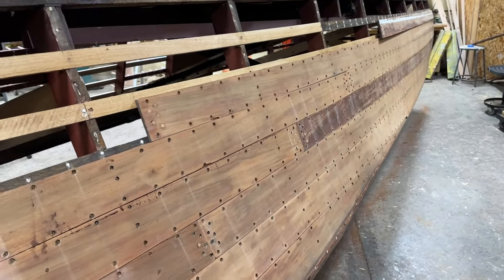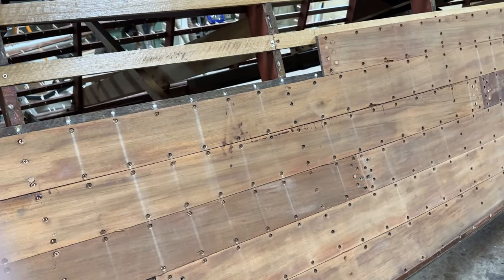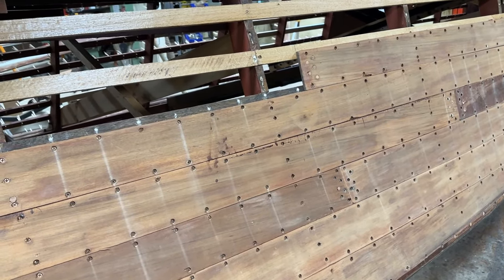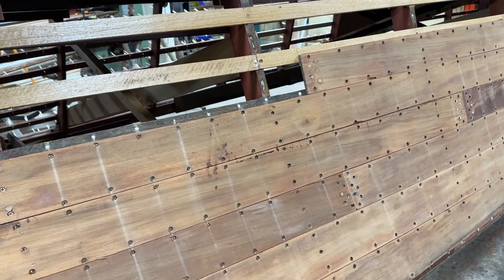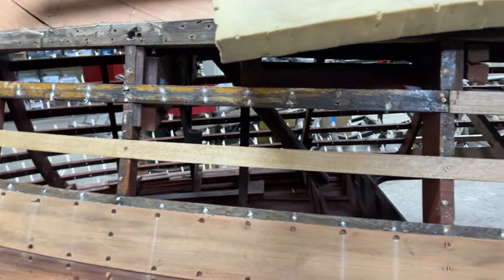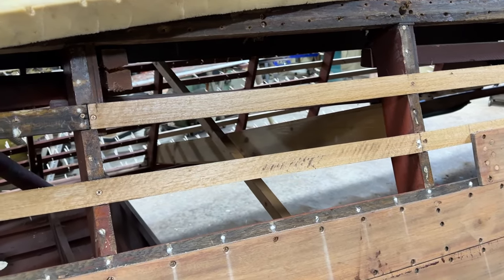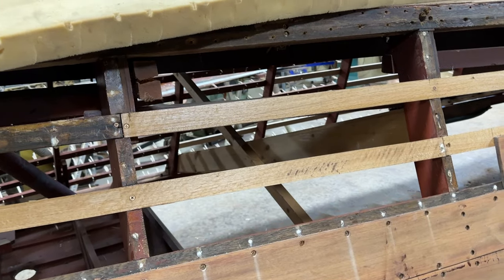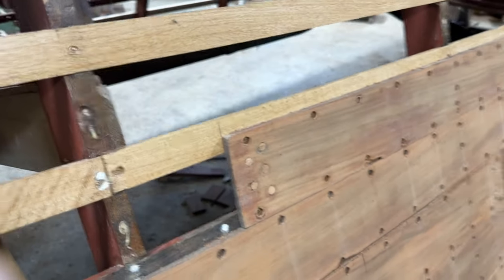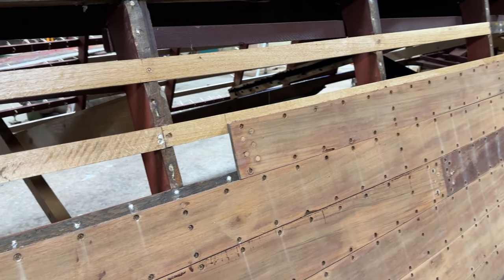Remember, this is all the original planking for this boat. We have yet to insert all the bungs — we know there were 8,000 toothpicks, and since there was more than one per hole, we'll be putting in far fewer bungs. Rick has replaced many of the battens, with more replaced higher up on the hull side. Once this all gets installed on both sides, Rick and Joe will climb beneath it and CPES the inside surfaces, then paint them all with Sandusky Paint Company Chris-Craft Maroon Bilge Paint.